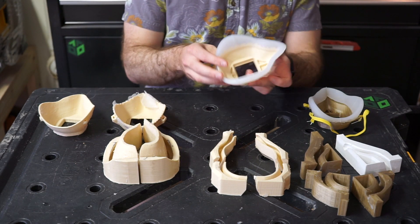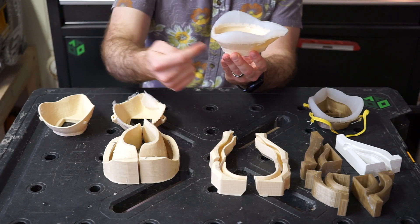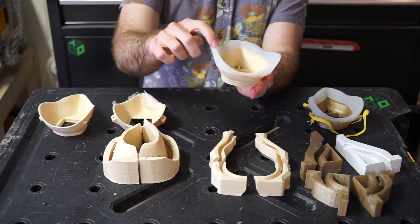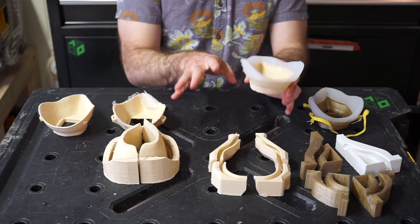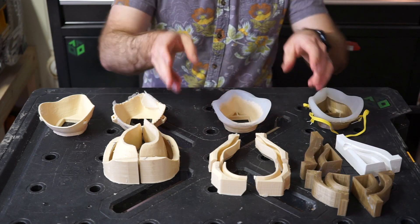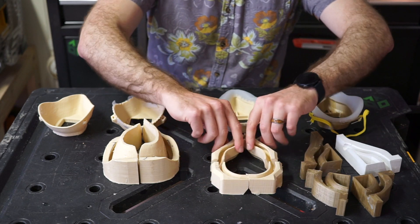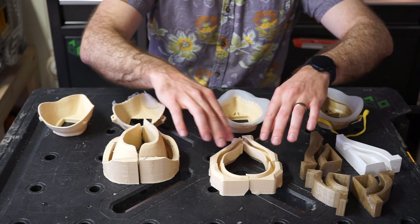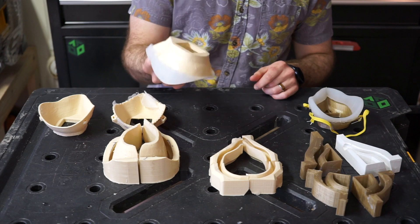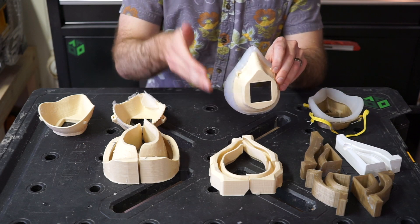From there I moved on to a design where I started cutting the Montana mask on a single plane and then modeling in some circles for the silicone to bite onto. The silicone there is flat — I was mostly fighting my solid modeling software to thicken the geometry of the walls so I could get a mold that worked. I also heavily focused on saving material to reduce print time, but saving material meant it did not clamp together well — tons of leakage everywhere, my whole table was full of silicone, and it made the mask difficult to remove. There were only two tie-down straps, so I was just focusing on the mold process at that stage.